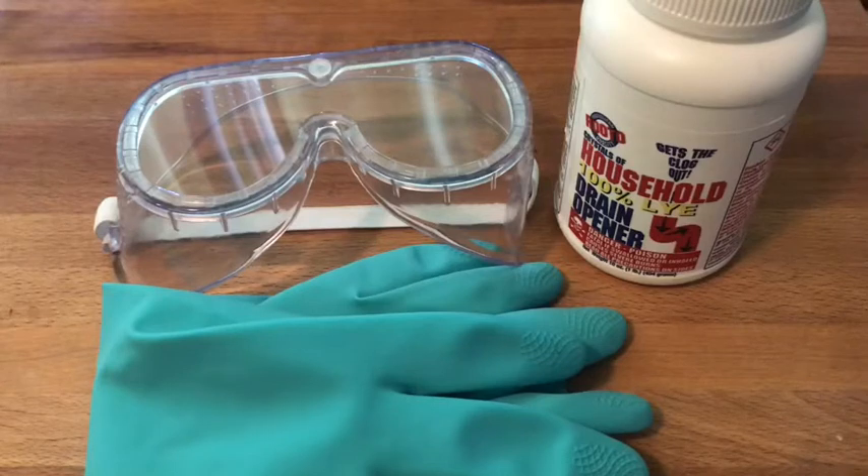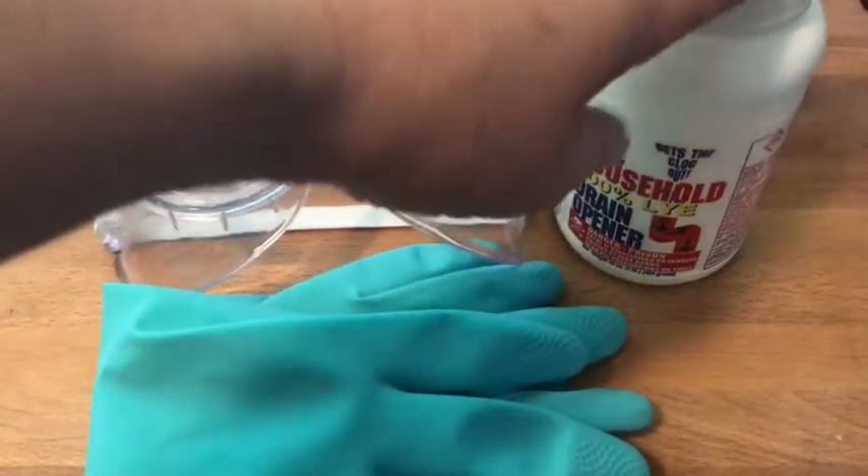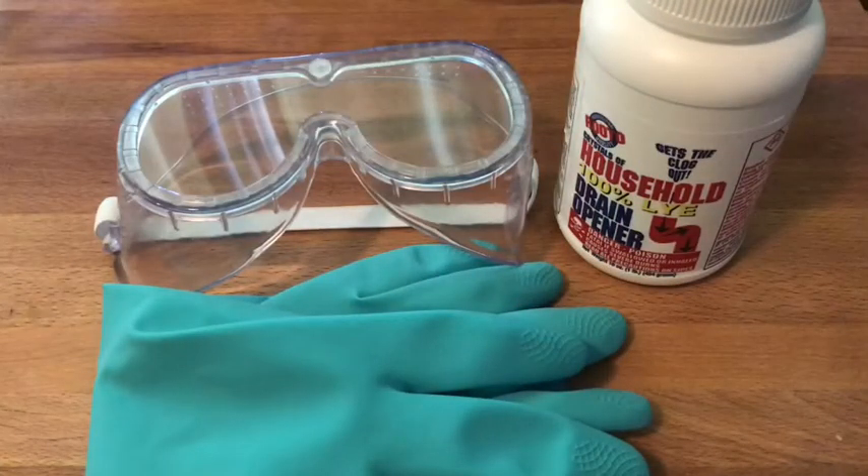There are a couple of things you need to be very careful about. You always want to make sure you're using cold water, and that you add the water before you add the powder. Once you get that under control, you'll want a container that's big enough to hold the solution and whatever pieces of iron you're putting in there. I find it more effective to use a lye bath in a warmer situation, so I put it out on my patio against a wall that gets sun most of the day. It won't work quite as fast if it's in a cold solution.